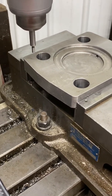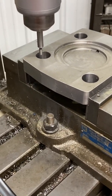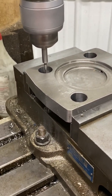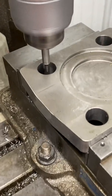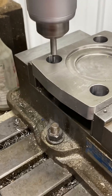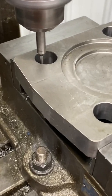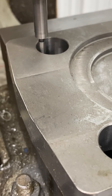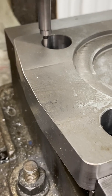I'm going to come over here, get it close, and bring it down. I'm going to put it somewhere where it looks like it's going to line up and get that down in there. Refer to my edge finder video if you want to know exactly what we're doing here. What I'm going to do is come all the way to the left side and bump that until our edge finder wiggles. Watch it close — there we go, see that? It'll wiggle.